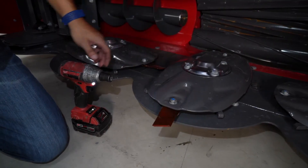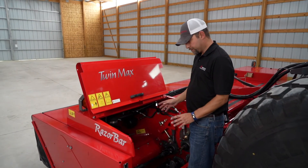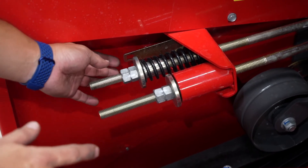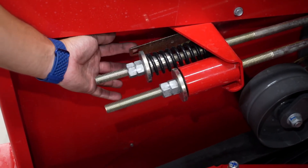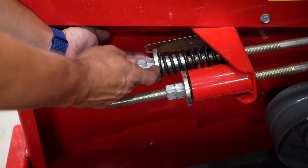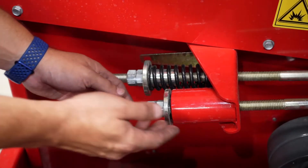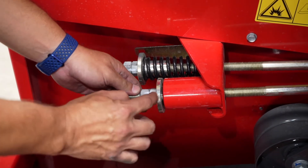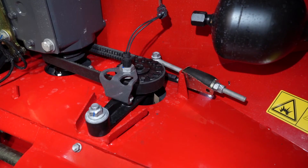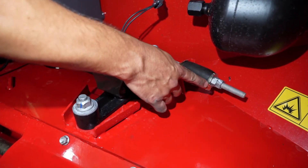A couple of items to make sure you check at least once a season, if not more — some changes and adjustments you can make. Maintaining proper belt tension is key to making sure the 9300 series head works properly. On this bar here, there's a window cut out. This window lets us know we're in proper tension. This washer here — you can move it back and forth by loosening or tightening this nut. As long as it's within this window, you're in good tension. Also, you have a cup here — make sure this washer maintains a one-eighth inch gap between the cup and the washer. Your other belt tension is right down here on your cage belt drive. To maintain proper tensioning, make sure this washer stays within this window on the bar.